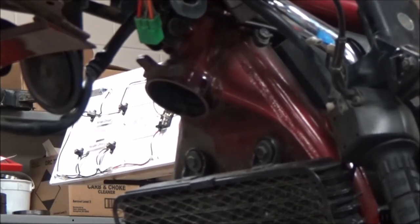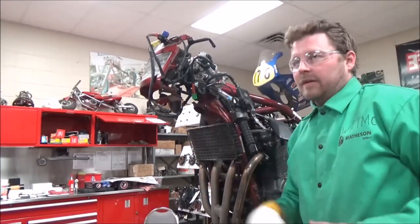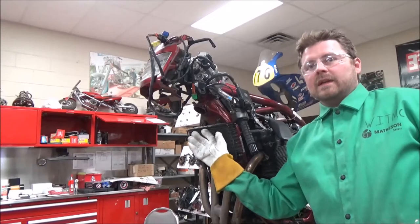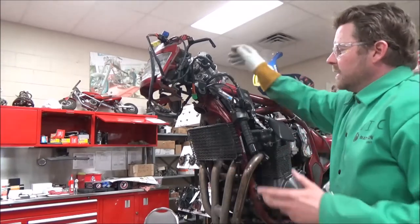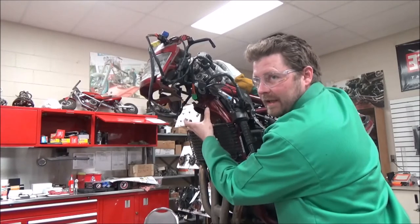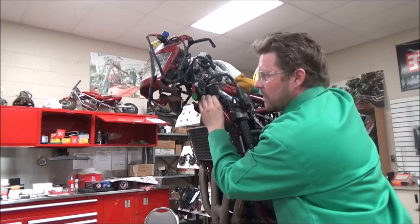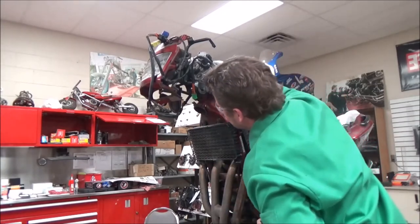A student made a comment absolutely worth noting: isn't welding on that possibly going to affect the paint? Yeah, that's definitely a risk. Another thing — I'm not welding the frame here, but there's still ambient heat around there. What you can do is have a quenched rag ready and be cooling that right away from the outside to try and help with that.